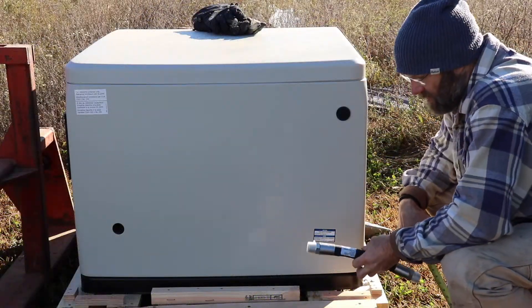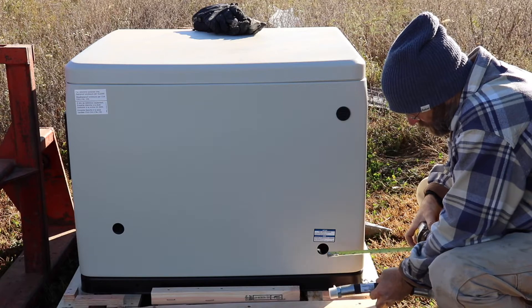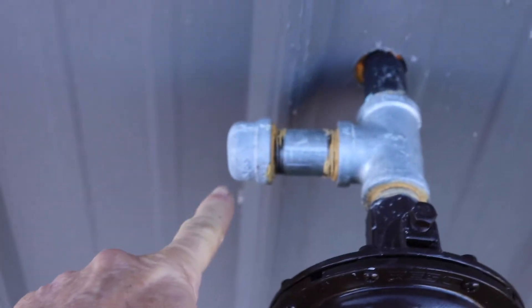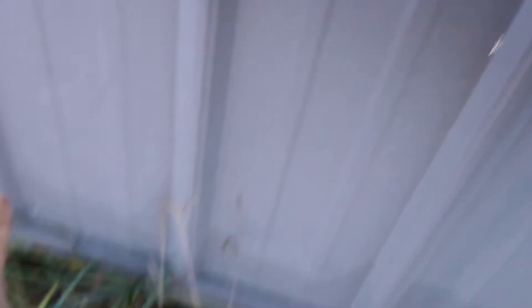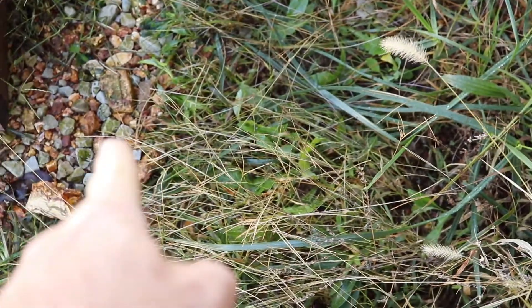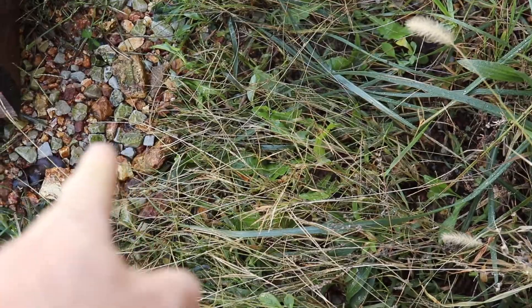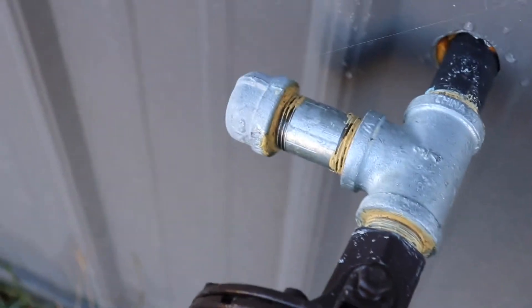This hose is included, so I'll work out of here tying in this hose. I'll come over here, couple right here, turn down, turn 90 to the left, put a union there. Also, I need a valve, so I've got to put a valve too.